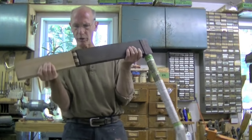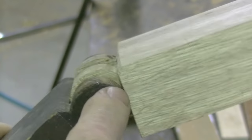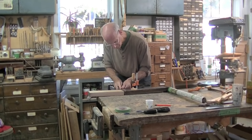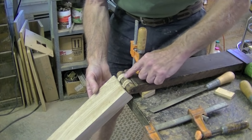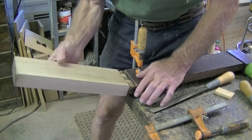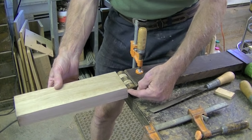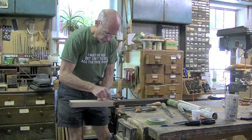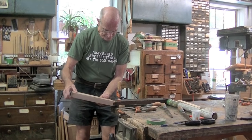It actually works — not great, but I can see that I need to round over my knuckles to match the old ones. They're bigger. I'm going to do that while it's in place here. Then I think it's going to work fine. Now, even though I've got my knuckles shaped pretty good — I can take a little more off there — I'm still having problems right here. I began to realize that the old knuckles are binding into my new piece. I think I have to cove out this area on my new piece. I looked at the table and I think that's what I'm seeing — I'm getting a little bit of binding right at that point.